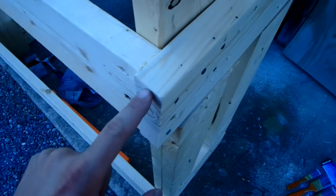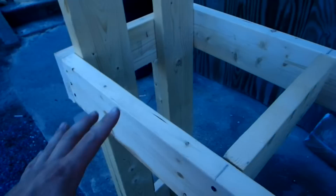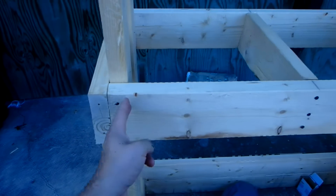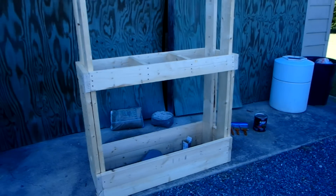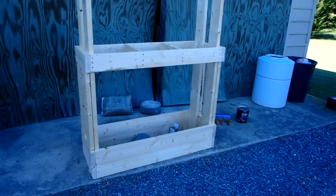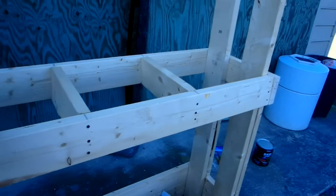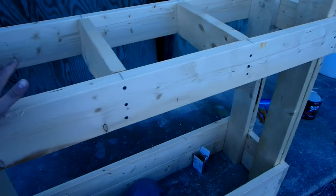That mistake made it 3 inches too wide and 3 inches too short — meaning a 75 gallon would not fit in there at all. I thought about it and said it's salvageable, we can fix this. So I came home from work and unscrewed the whole thing, however many screws I had put in there, and last night I took two bracings out, going 16 on center.